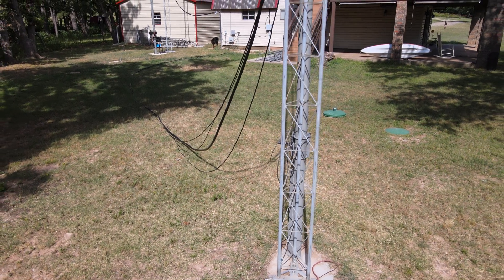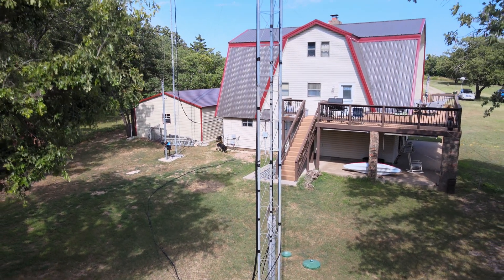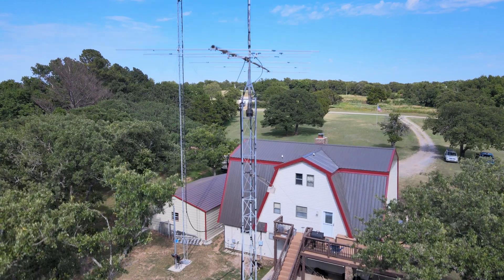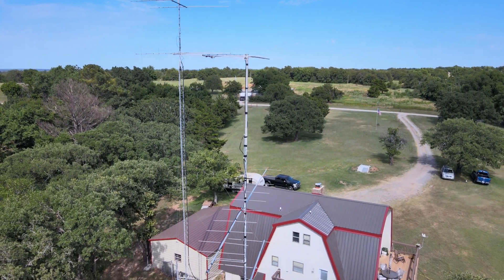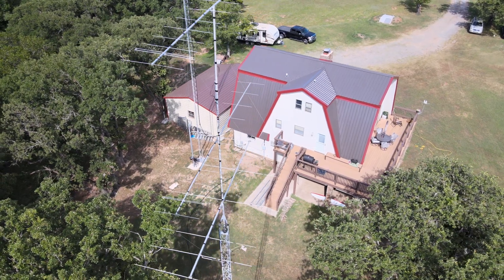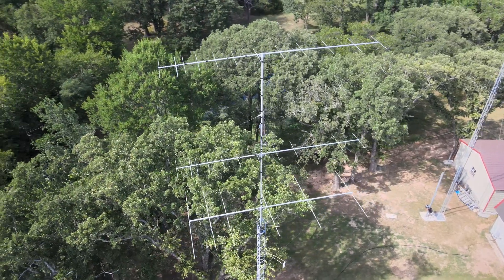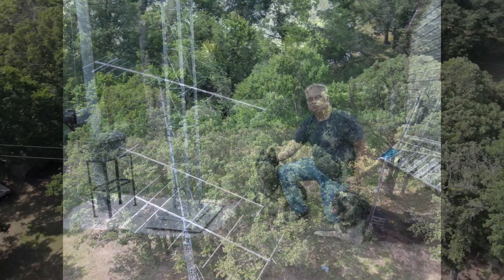It's not as high — it's a five-section tower with a mast going out the top. It also has seven-eighths hardline running to it, though the routing is just temporary right now. That's the six-element beam for six meters. Here are my two stacked M-Squared 12-element beams for two-meter sideband: the top one is at about 70 feet, and it drops down 11 feet for the second stacked beam. The small fiberglass pole on the right-hand side is for an 80-meter dipole, which works fairly well.